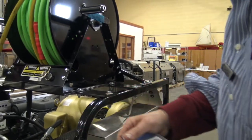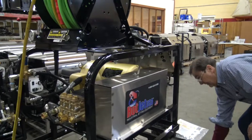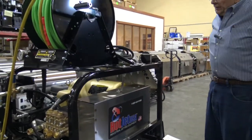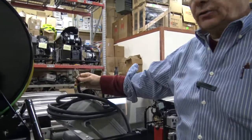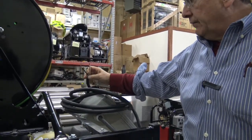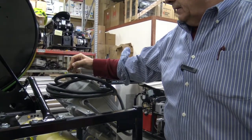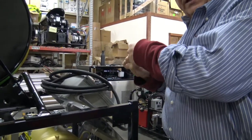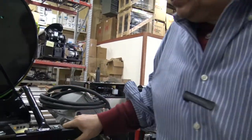With this unit, I'm going to go over the machine just a little more. When you go to hook this up, it needs to be hooked up by a certified electrician. It's a 480-volt, three-phase unit. That power cord might be cam-locked out on an industrial application.